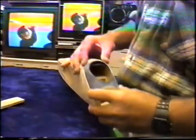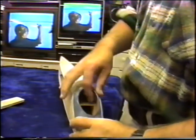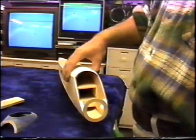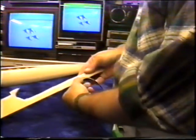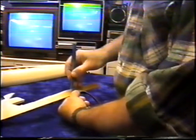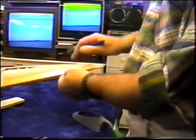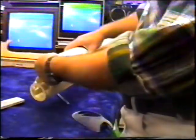After making that alignment, I can see I've got just enough. Boy, that just worked out perfect. Now I need to make up a little plywood piece for across here so that I'll be able to put a blind nut in there, a piece of 1/8 inch plywood. Now the way to get this, the cowl usually acts as a little template, and that's kind of easy to figure out. See, a lot of times figuring out these shapes can really be a bear. But you have the cowl already made up. Now you're also going to have to get that angle on there so that when it matches, you're going to have that angle.